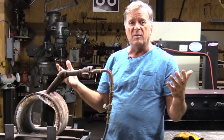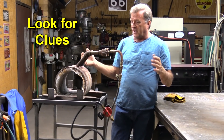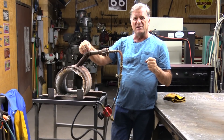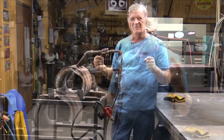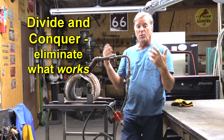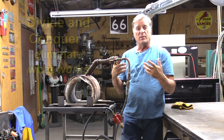So how could you figure out where the problem is? He said one burner was working — it seemed like the other one didn't want to burn right. He had a nice blue flame out of one, and every now and again a yellow flame out of the other. Well, that's a clue right there. The first thing you do is eliminate the things you know are working, to narrow it down to the things that aren't.